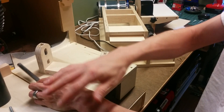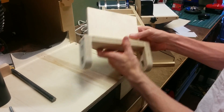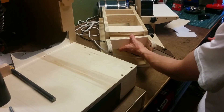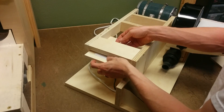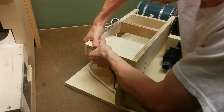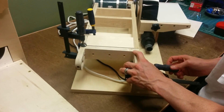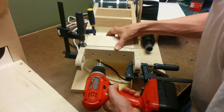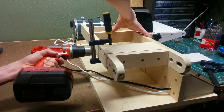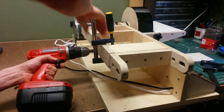I've got the holes tapped in the shaft, but before I assemble everything together, I need to fasten this piece of plywood on the back end here, and that serves as the sliding action for the tension adjustment. I originally designed this idler system to slide in and out of the main housing for that quick-change ability that you see on most conventional belt sanders you can purchase, but at the end of the video you'll notice I didn't actually implement this. I left that feature out because there's enough adjustment range in the tracking that I don't really need that extra sliding mechanism, and I just left it out for simplicity since I don't really foresee myself having to change the belt very often.